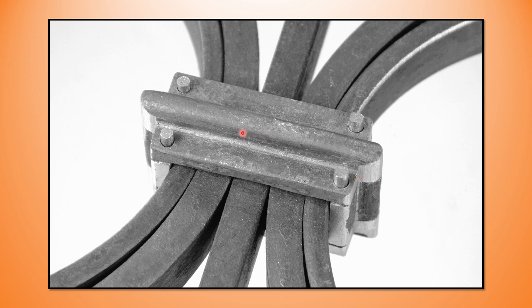I am going to put a little bit of JB Weld under here just to keep everything snug so it's not a loose fit. If you have a tight fit, and tight fit can't be much because you've scribed everything, you can come in, because this scroll is curved, you've got a pillow of air underneath here. So all you have to do is file the very corners here, which is not going to affect the integrity of your tenon, and you can get a nice fit. So again, just getting rid of those corners is going to help you if you've got overly tight.